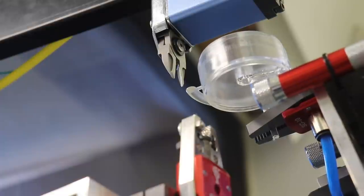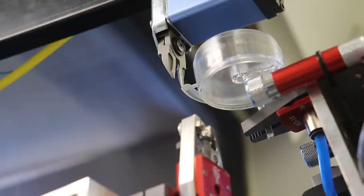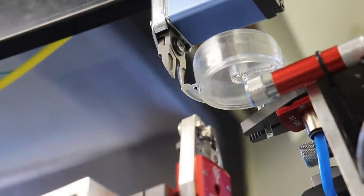And we need to basically update both robots to do this. So it looks like the clipper is going to hit. We're going to have a problem with the tip of the cutter hitting the runner. So I'm going to switch the orange robot to teach mode. We're still in the same position in the program, but now we want to start to update the location, because we have an actual true position of the part on the gripper as it came out of the hot mold. So now I'm going to start fine-tuning the location of this point that's recorded in the program for the orange robot.